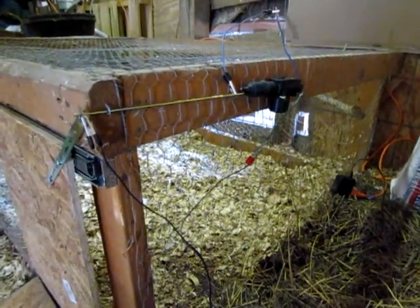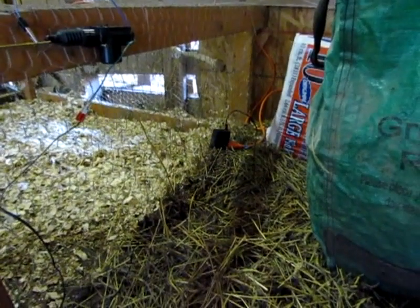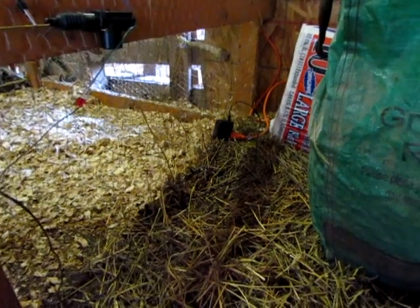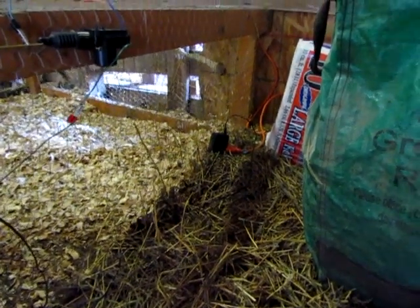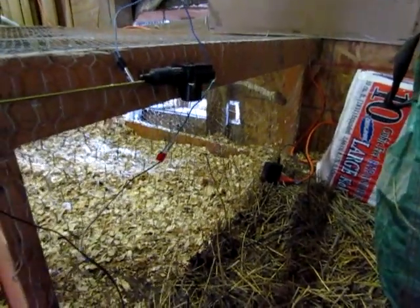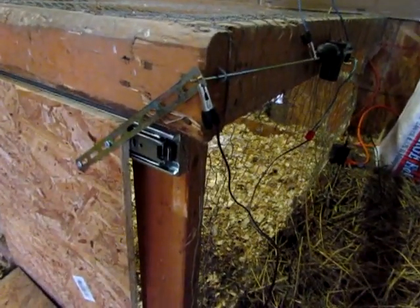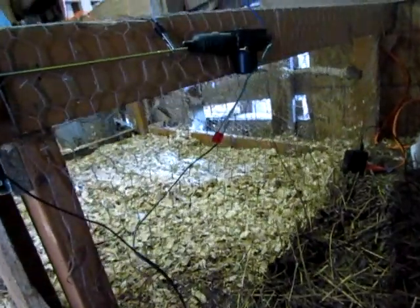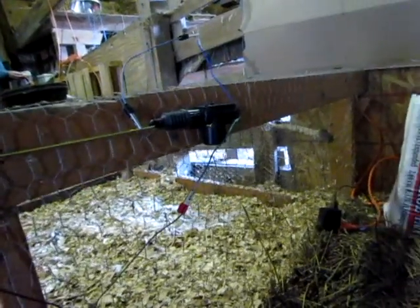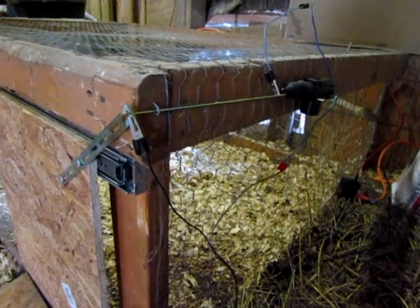What I wanted to do is have power cut as soon as the door opens. The way I've wired this is I just have an old spare 2-amp 12-volt transformer brick plugged into the timer at the end of the extension cord, and it's wired so that the positive goes to the actuator. The negative comes over here to this side and it's just attached to the bracket, and then the circuit is completed by this other alligator clip here, so the current runs through the rod itself and then into the actuator. When the door opens, it will break the circuit and cut the power.